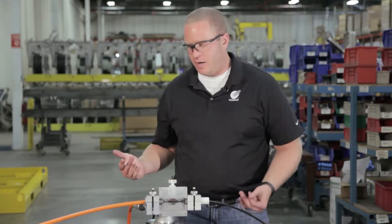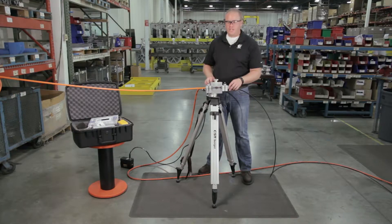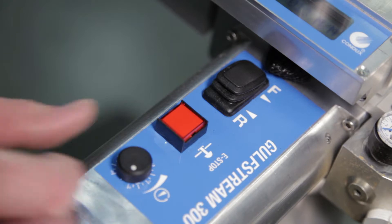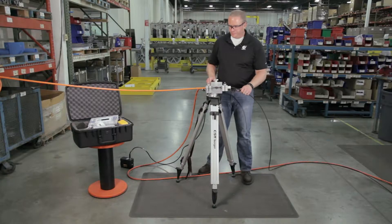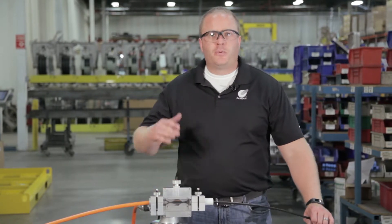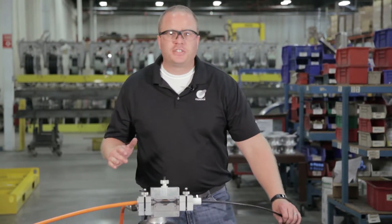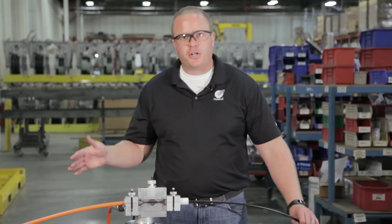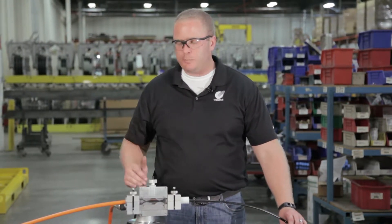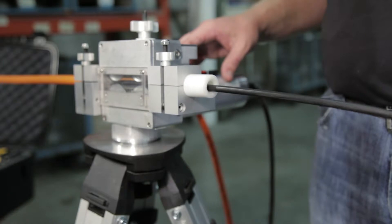I like to install on the third menu which toggles between distance and speed, so you know where you're at at all times. I want to have the speed all the way down, then push forward to engage the tractor drive and slowly increase the speed. We don't want to add any air yet until we get a good amount of fiber into the duct. As your speed starts slowing down with just push force, gradually add air as needed to get that speed back up.